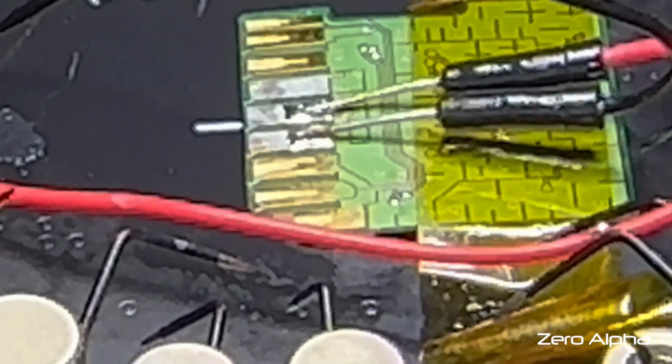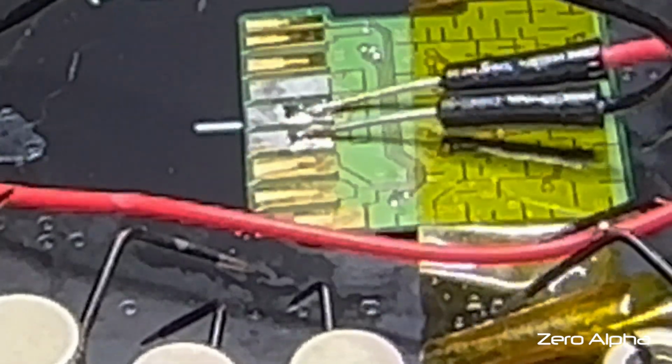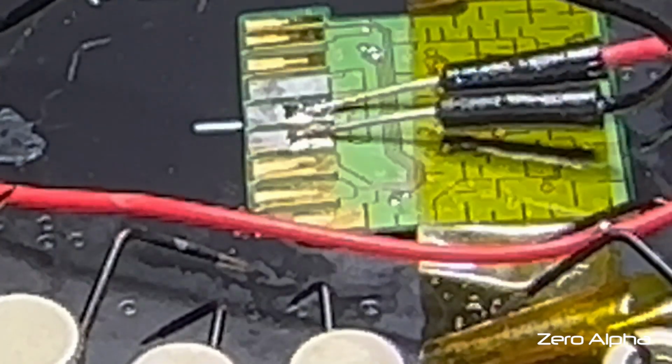I've decided I'm not going to bother repairing the little trace wires. Instead, I've followed down the wires themselves and I've found little vias. Vias are holes that connect a trace wire through to the other side. If you have a look here, I've soldered them over a bit. That makes it easier for me to actually connect the probes to it. I can also test the pins, and I'm going to have to write down which little via is what pin now. But I can at least test them all.